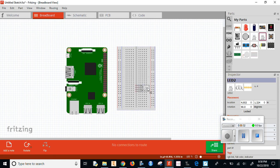First I'm going to throw this in anywhere, and you can see the green ones light up, showing that those connect in. All right, and now we need to find three places where we can connect. Well, we can have GPIO21 connect here. The next one is GPIO20, connect there. Notice I'm skipping the long one. And then the next one, GPIO 16, we can do the top one.